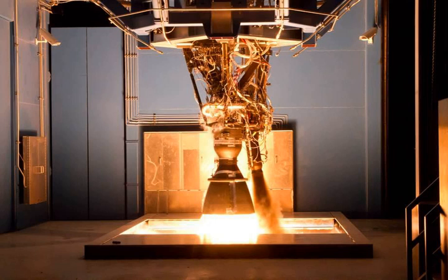The increase is due to the greater expansion ratio afforded by operating in a vacuum, now 165:1, using an updated nozzle extension. According to a SpaceX payload user's guide, the Merlin 1D vacuum can throttle down to 39% of its maximum thrust, or 360 kN.